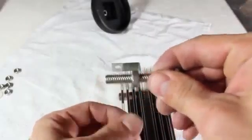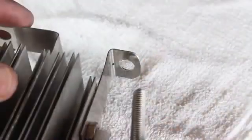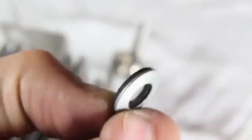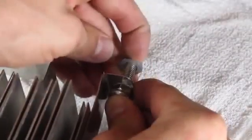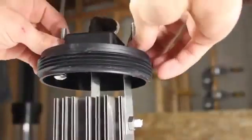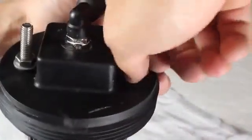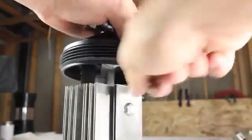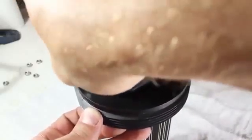To do that, I'll add a nut to the 5/16ths inch by 2 inch stainless steel bolt and push them through the hole in the right connector strap. This ¼ inch washer is stainless steel on one side and rubber on the other, and I'll push that down the bolt with the rubber side up. That's all repeated on the left side, and now the cap is placed over the bolts. Two more washers are added with rubber side down and secured with another nut. Using an allen wrench, the nut is tightened securely, and then a few more nuts and metal washers are added to the posts for convenience.